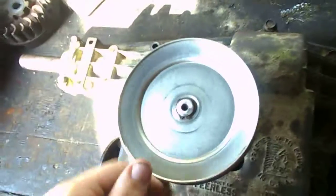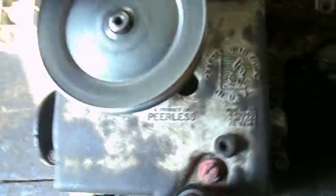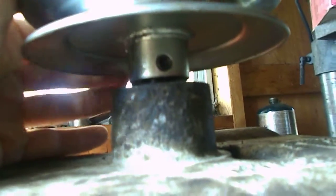Here's the A20. I got the new pulley on finally. I had to grind down the spindle part. Now it's all perpendicular. It has that little keyway on there. That'll help it — I might set that set screw there to help it stay in place. It's very hard now, no play whatsoever.